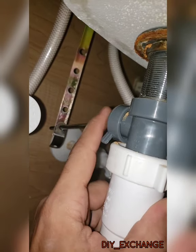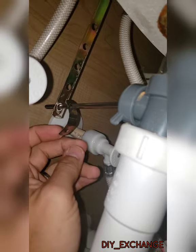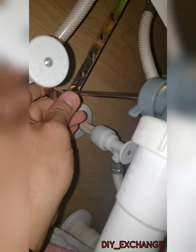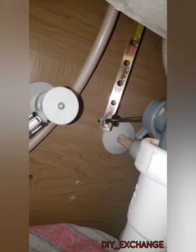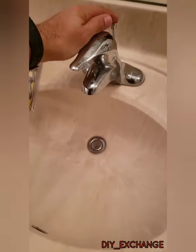I went ahead and put the new piece in and confirmed the stopper on the sink was going up and down with my test. I got it right in that loop, and as I mentioned, I left one hole of the fastener open on the rod so that when I put the shaft back in based on the original alignment, I could squeeze it to get it into the little hole. Now it's fastened so it doesn't fall out. Here's the completed project - lift this and the stopper locks, push it down and it opens.